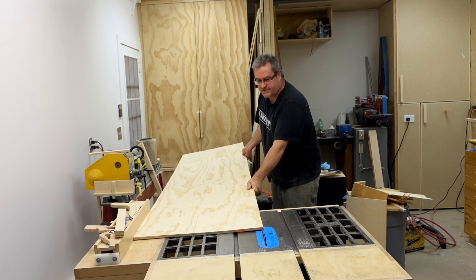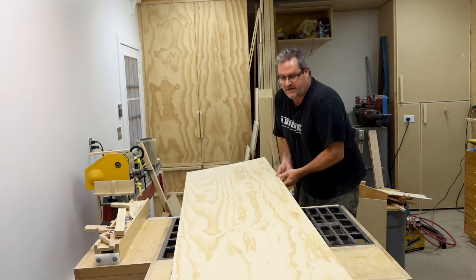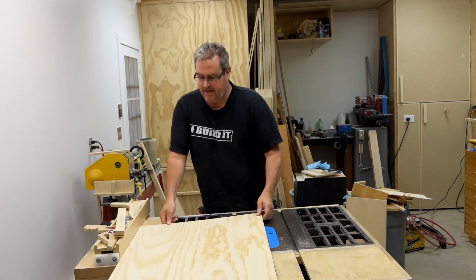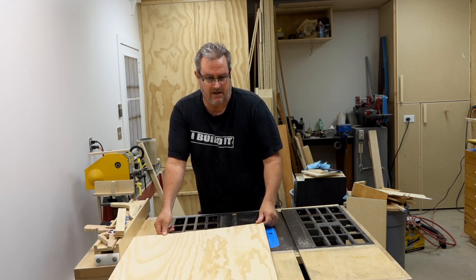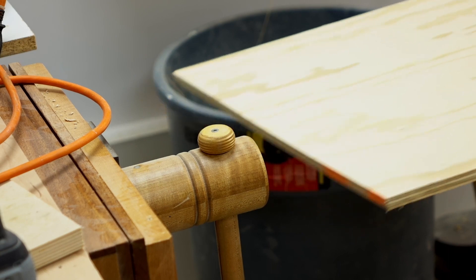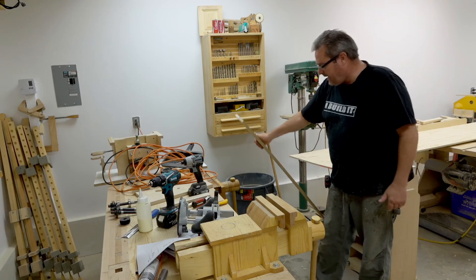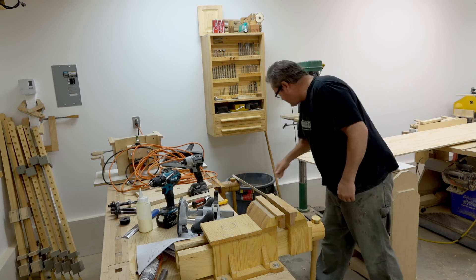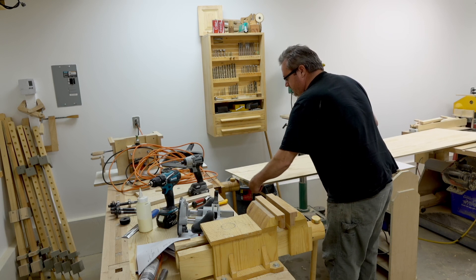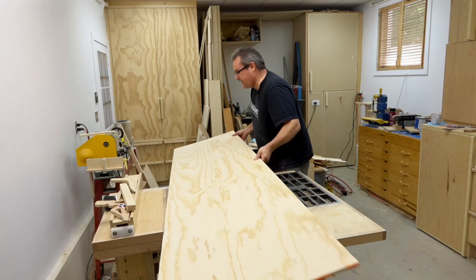Because it's going to be too late once you start. Looks good on the infeed — there's nothing there. I'll quickly run it through the outfeed and check it there. It looks like I'm going to hit my vice on the end, so that's not good. To fix that, I can either move my table saw a little bit, or I can add something here that will catch the piece of plywood as it comes through so it rides up on top and I get the clearance I need.